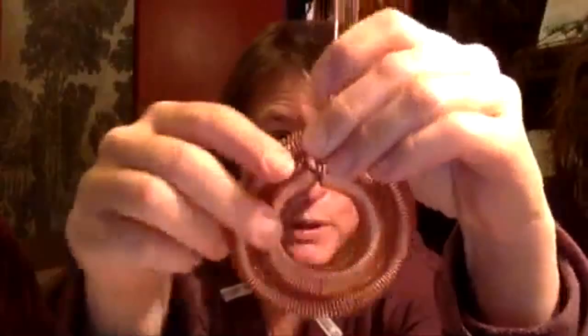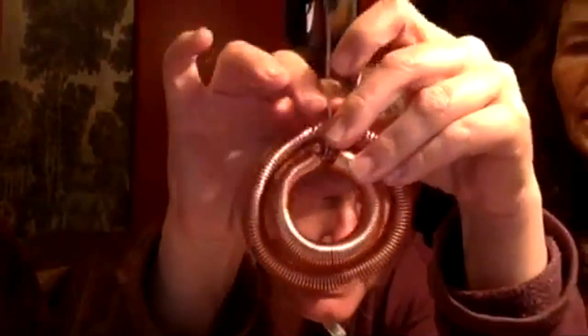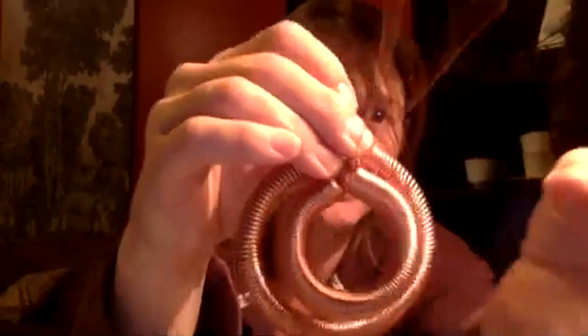I really just, this is from your perspective. So to me, this is the front of the coil. Can you guys see her showing as the main screen? Okay, because we don't see her. So your A and your negative in and your positive out are all kind of on this side. So I have it reversed towards me. So your A, it comes in here, the energy, the small coil goes around again, loops up, goes around the big one, goes around again. It does all that. And then it comes down and it goes to the bigger, fatter coils, goes here, goes up and goes here, and comes out the end. Is that correct, Flo? Exactly.